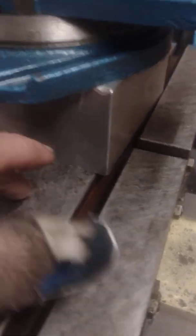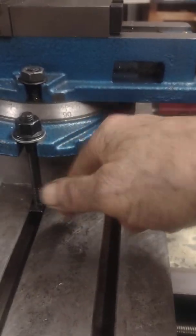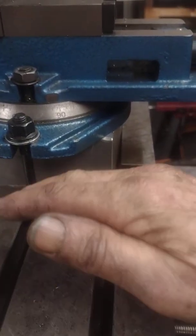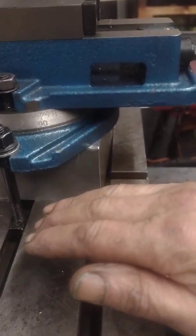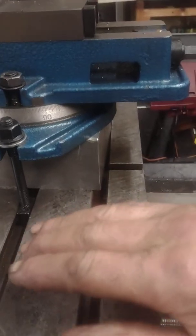It took me a long time to figure out what that was, but I got it the other day. Inside the table, for the lead screw, is a big brass nut with a hole in it, and it's got a post sticking out — it just sits in a hole down in there with nothing holding it in. What was happening was it was rocking back and forth in that hole when you change direction, so it would jump all of a sudden when you came back.